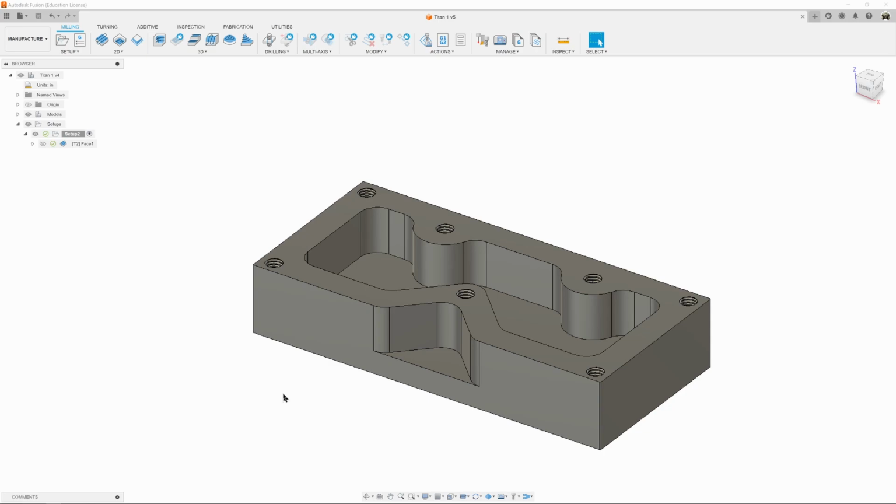We're going to do that with tool number 4, my designated aluminum end mill. It's a YG1 AlumaCut 3-flute center cutting end mill. It has a 5/8 inch long flute, so the most it can cut is 5/8 of an inch. But we're going to back that off a little bit, and we're going to cut no more than 1/2 inch at a time, which means we're going to need to do multiple depths, since the entire thickness of this part is 3/4 of an inch.